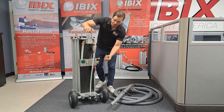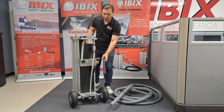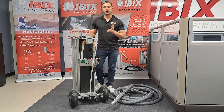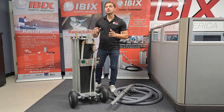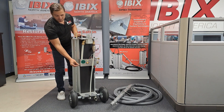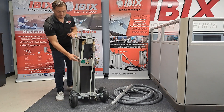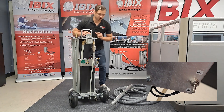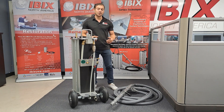Just underneath the water connection is our three-quarter inch airline. This machine runs off a 185 CFM compressor when using the single airline located at the side of the unit. What makes this machine different from all other IBIX systems is the dual airline feature. With the 185 CFM you can use the single airline, but if you're using the double airline feature at the bottom you'll want a 375 CFM compressor, which will basically double your speed for more production. On the other side of the back plate is our off and on switch for the turbo option. In the off position you're running only the single main airline; flip it on and that opens up the secondary airline, doubling your speed — more production, more volume, more strength.